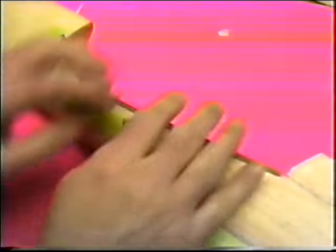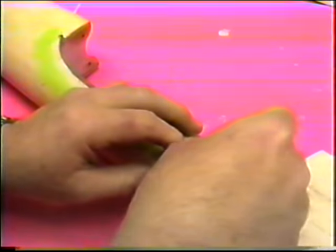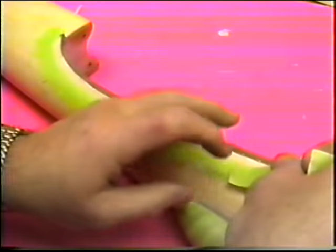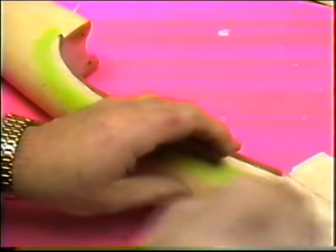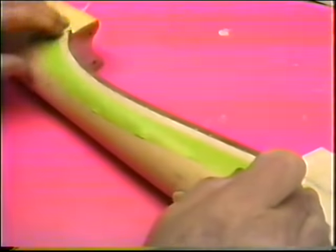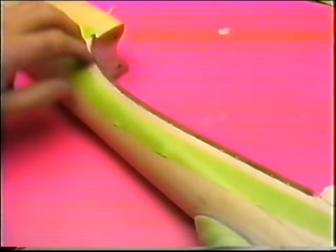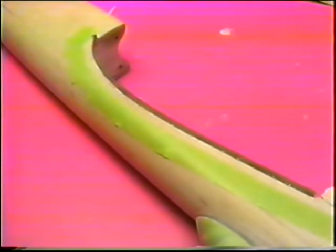Now one of the things we learned about Aeropoxy early on is it's made to go off at 72 degrees. So if your shop conditions are like mine, about 58, well, it gives you more working time, but the material tends to be a little thicker and harder to apply. So what I try to do is, before I'm going to do a fillet like this, put the material up by a heating vent, let it warm up a little, get it up to about 72 degrees.